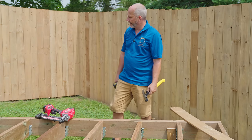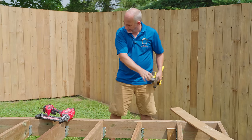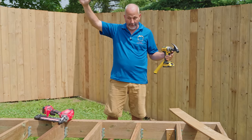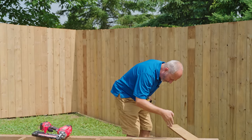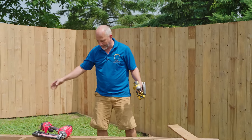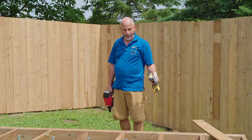Solid as a rock — that's awesome. We'll do the same to the other side, and now we've got the structural component of a double beam carrying all the live load and snow load from the roof. From this half of the building down to two point loads — all the way down, it'll hit this, transfer to this point, go down that four by four to the ground, which carries the 1800 pounds at each location. That's basic structure 101 for decks, and that's going to be the way it works for our backyard shed.